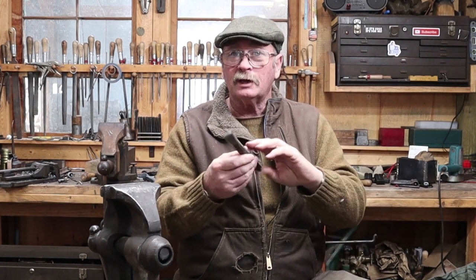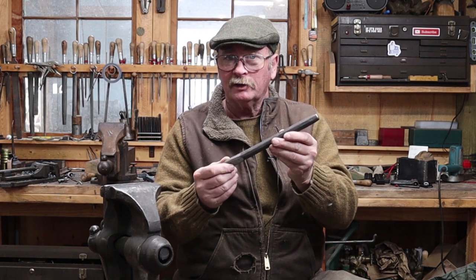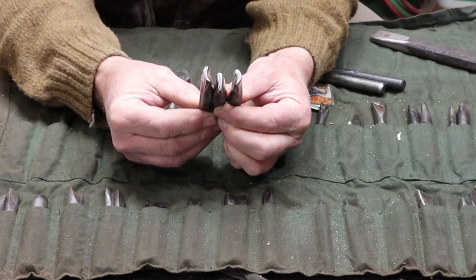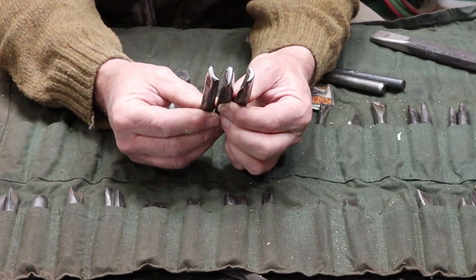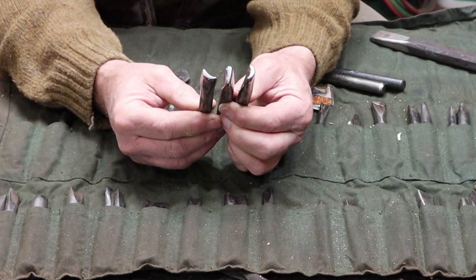These are about 5 inches long. I'd rather have a tool that's more like 9 to 10 inches long at the anvil. The tools I want to make today are teardrop shaped tools used for creating details — they can make really nice floral details. We make these in a left, a right, and a center version, and they end up looking something like this. You try to make all three of them the same, except the lefts and the rights are curved.